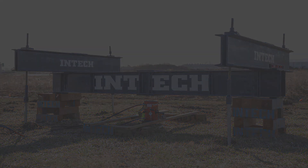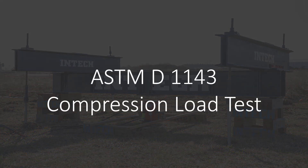This video will demonstrate how INTEK sets up and performs a compression load test for small shaft deep foundation elements. This could include helical piers or hollow bar micropiles. The actual components of the load test may vary by individual project, and the proper current ASTM methodology should be followed. Prior to performing any test or material installation, review the most current methodology documentation to verify that the equipment and planned steps are consistent with the requirements of the test.